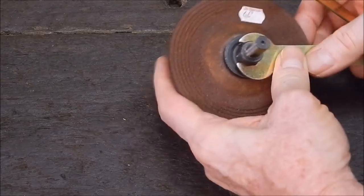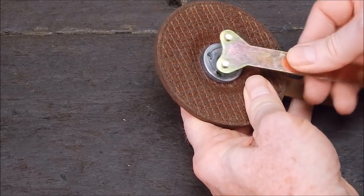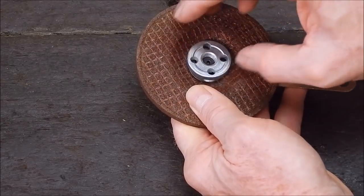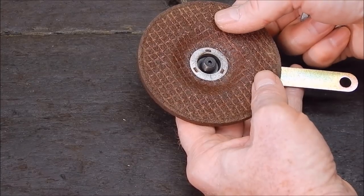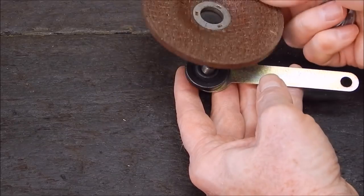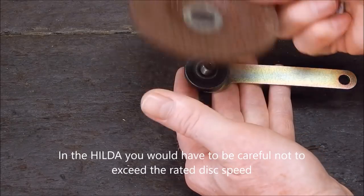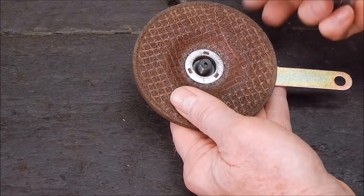Using these discs with an electric drill, it obviously won't spin anywhere near as fast as an angle grinder. An angle grinder spins at around 10,000 RPM; the fastest you'll get from an electric drill is about 3,000 RPM. That's actually a safety factor since you're running these unshielded — you've got to take precautions, stay away from the line of fire, and wear all the safety gear of course.